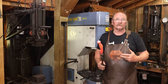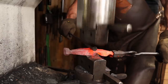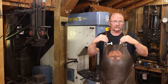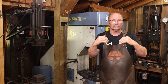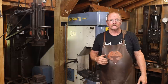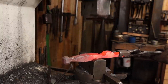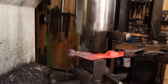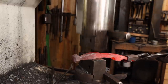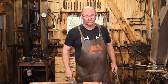Just a different approach depending on your skills, your materials, and your tools. Adding the second fuller on the back side helps kind of open up the first fuller so you're less likely to push material into that groove and create a cold shut. This is a good way to help prevent cold shuts when working this way. Of course you can also do this under a hydraulic press or a fly press — whichever tools you have available is the right tool for the job.